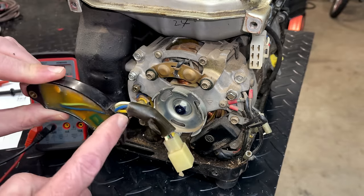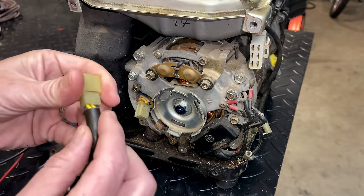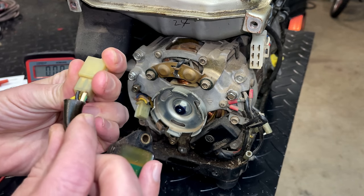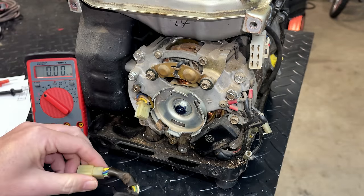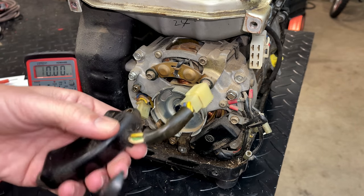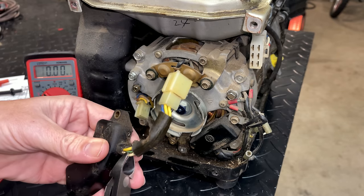I'm going to cut these wires off. We'll plug it in, supply power on the black and the white being positive, using a power supply, and we'll start it up. No power applied, see what the residual magnetism is, and then bring the voltage up on the field and see how much we need to get to 120 volts. I'm going to chop this right at the bottom so there's no going back.